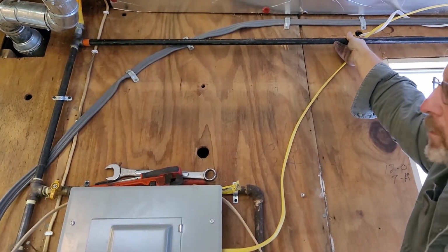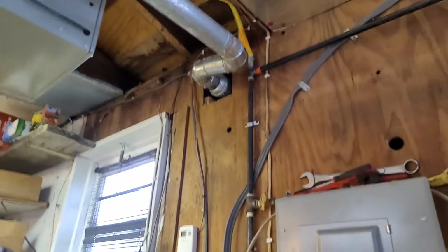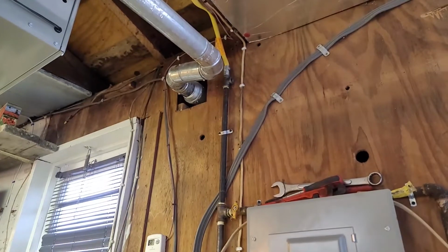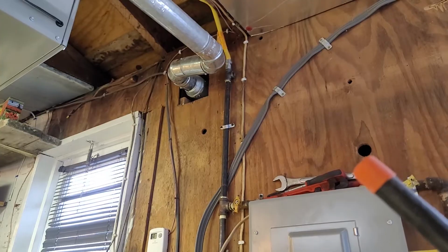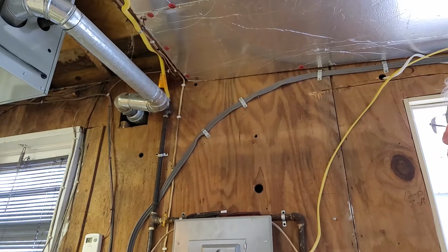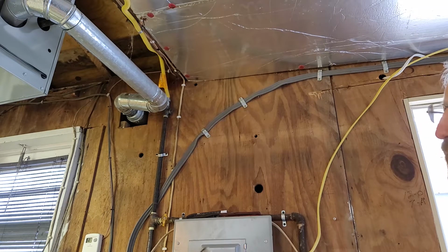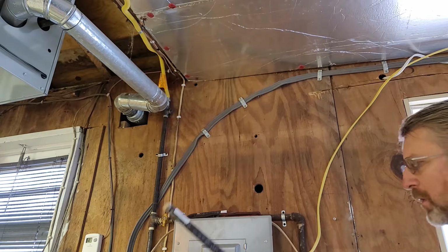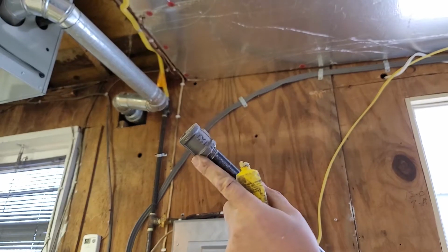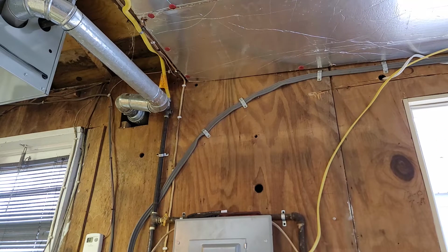and then it's going to be just above the door and a little short. So I'm going to take the coupler and put it on the end also on the bench, and I'll put dope on both ends. Alright, I got pipe dope on the end. I do about 4 or 5 threads. Just stick it on there and I take my thumb and kind of ooze it around. On the other end, I put the pipe dope on and I put the coupler on the other end. That's tight. I did that on the bench. Save me the trouble from doing it up there.